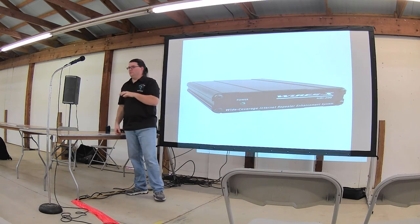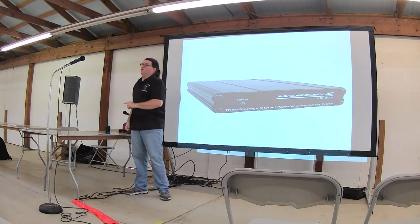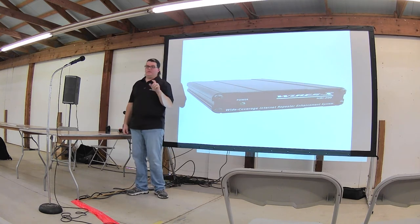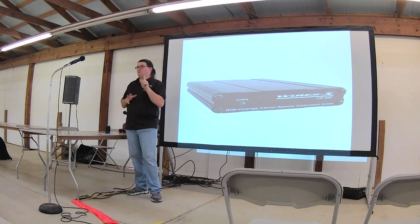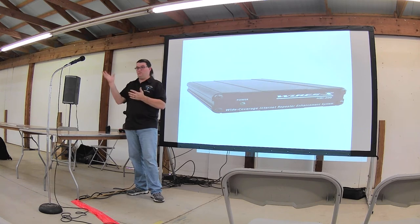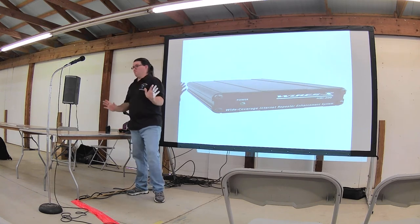Anyway, so everybody's got DMR, familiar with DMR. Now, did you know you can get on the Fusion network with those DMR radios? Believe it or not. That's where the hotspot also comes in. Most hotspots call the OpenSpot 3. That's another conversation. You can do what's called transcoding. You can go into a hotspot with a DMR radio and come out on a Fusion network. And vice versa. If you have a Fusion radio, you can go into the DMR network. So that's another plus for the hotspot side of it.